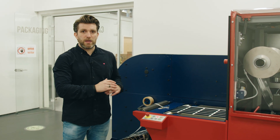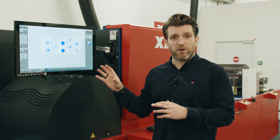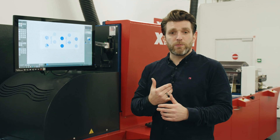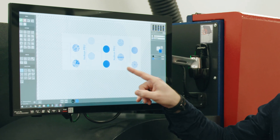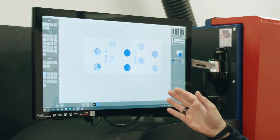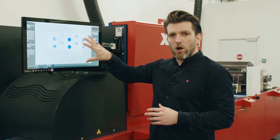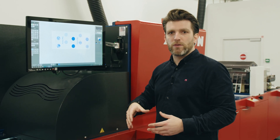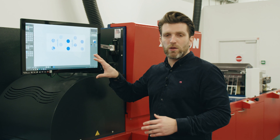What we haven't discussed in terms of hardware is software. Going digital is of course very much attached to very good software, and that is exactly what we have on the FEU: a highly intelligent software with a very good user interface, great communication, and high flexibility for the operator. For instance, there is an editor that enables the operator to look at an image and add trapping, switch the varnish image, or add textures into the varnish or foil. This also enables you to have the customer in and do adjustments or create images on the spot — no need to go to pre-press or order new tools. Do it all here at the machine, all in one go.